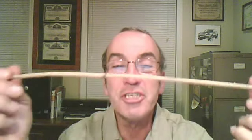Now, let me also explain to you about this wire right here. Although it looks good, and it only cracks where you bend it, this wire is in excellent shape because it was removed from the first floor ceiling of a two-story house. No heat exposure. This is in the middle of the ceiling. No heat from the attic, which in Houston, Texas gets up into the 150-degree temperatures during the summer. No wiring from the exterior walls, which get just as hot because there's no insulation in there. This is in good shape.